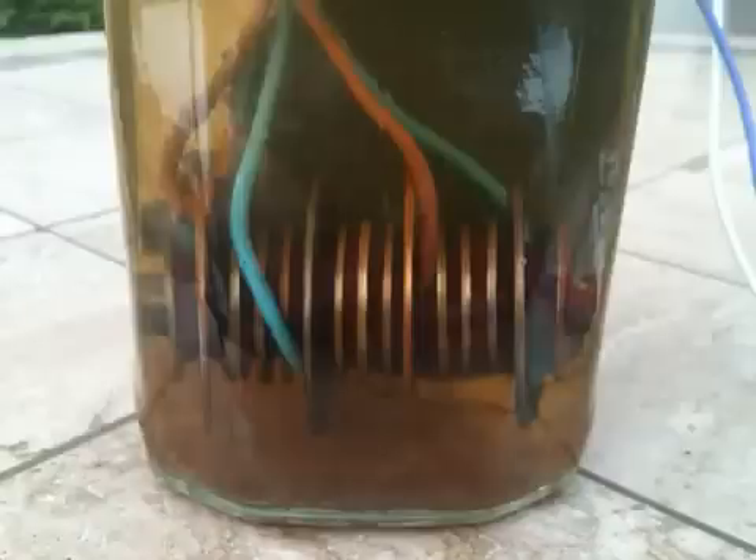I just wanted to show you the old vessel that I made using just standard cable. It's much better if you solder all the cable right the way to the top, because I was finding that the copper was corroding a bit. If you look at the left, you'll see the brown cable going to the big washer on the left, and then three smaller washers to the right, with a blue cable going to the next large washer, and carrying on right you'll see brown going to the next large washer and blue going to the next. Make sure that all your browns go to positive and your blues go to negative.